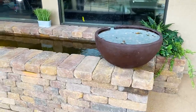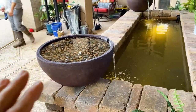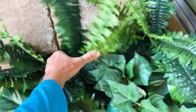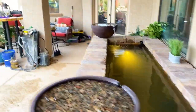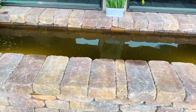I cannot wait to come see this at nighttime. Both of these bowls are running off of an AquaForce 1000 pump, ball-valved to where we've got just enough flow providing a ton of aeration in this pond for the size of it, and it also provides another opportunity of biological filtration. On the other side, we have the other pressure filter along with a pond heater and the transformer for the lighting system. There's going to be another heater installed on the other side — the temporary housing has one of the heaters in there, and that will be installed once this pond is the permanent home for those fancy goldfish.